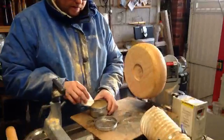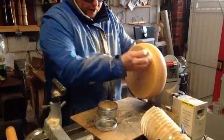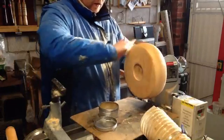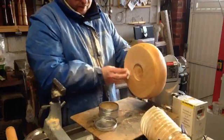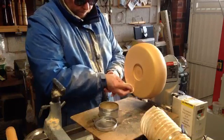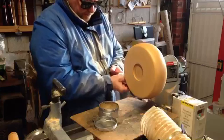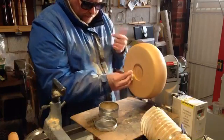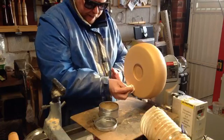So again, just apply the Yorkshire grit. Just a thin little kiss on that mortise detail. You don't want big clumps of finish in that textured detail. So, get it going. Start working this in, give that a kiss in there. Working it in, still listening all the time. You can still hear the powder in there, and I can still feel it under my fingertips.